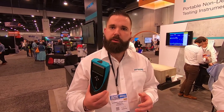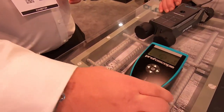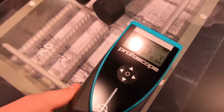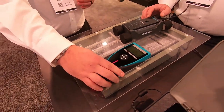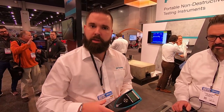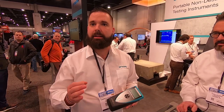What you can do with the Profoscope is scan over a rebar with a known depth and diameter. With that being known, you then scan the GPR over the same bar and tell the GPR that it is exactly 0.94 inches in depth. That will then give your GPR the ability to calculate the dielectric constant exactly.